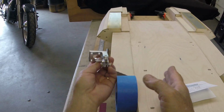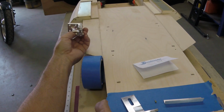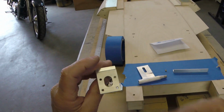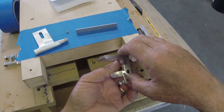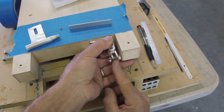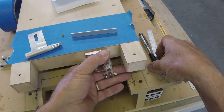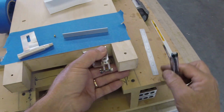Old school boats, way back in the day, they tried to line them up. You know what I mean? They'd get the rudder way over in line with the turn fin, just thinking that that made sense. Every modern full-size hydroplane now has the rudder on the opposite side from the turn fin. Why? Is it all monkey see, monkey do? Or did somebody convert their boat at some point in time and it worked awesome and they said, why wasn't I doing that all along? Anyway, we're mounting ours on the opposite side. Now, if we mount here, we can't turn very far to the left. Now you say, well, I don't want to turn to the left. Well, me neither, but you have to sometimes. So you can scoot it way over and give yourself some room. You can cut this at an angle here to buy yourself a little bit more room. I did that on my first eliminator.